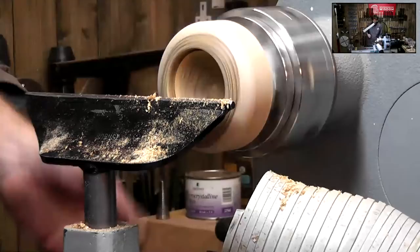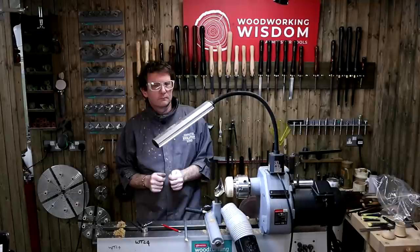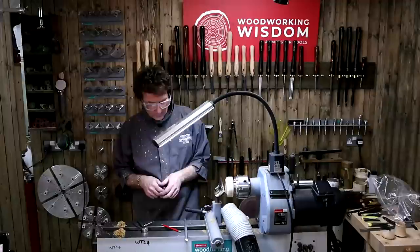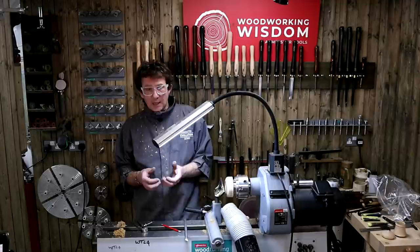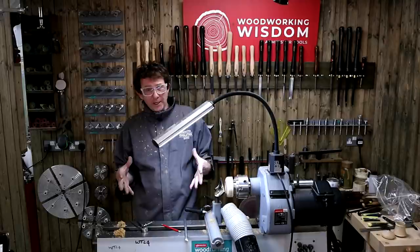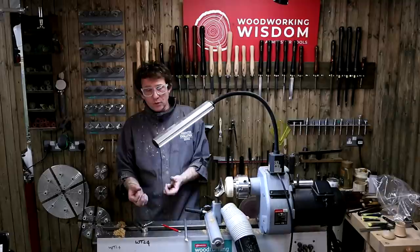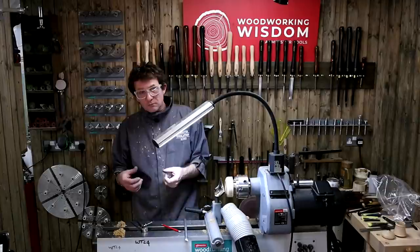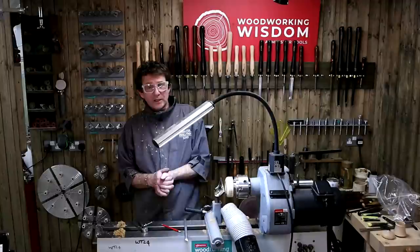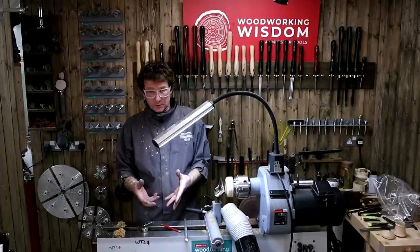Craig asks: Nigel has had inch-and-a-quarter screws snap when attaching a face plate to a bowl blank - is there a screw you'd recommend? Think about the size of what you're putting on the face plate. The deeper and bigger the bowl, the more it's going to need fixing. Think about how long screws need to be. If it's a bigger bowl blank with a lot of weight, you might want more screws. Certain bowls you might turn with four screws because they're smaller; for something 12 by four, you might want six. The face plates have a countersunk hole - make sure the screw is thick enough to grip it. Better to err on the side of caution and make sure you've got a good fix.